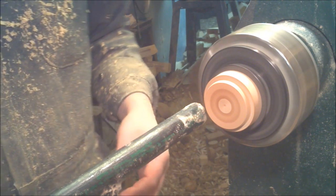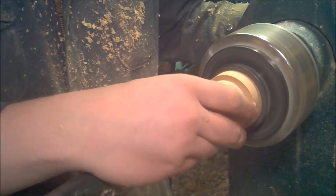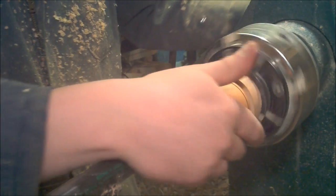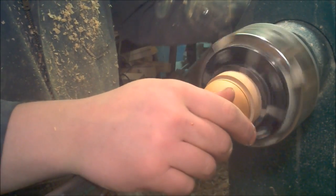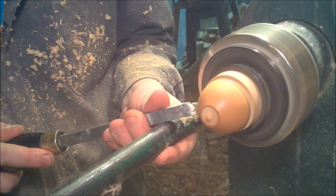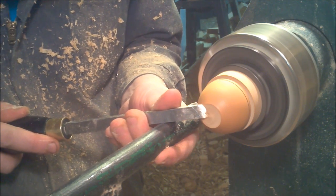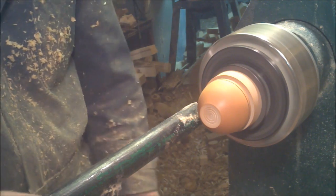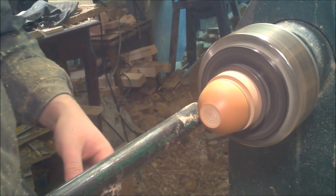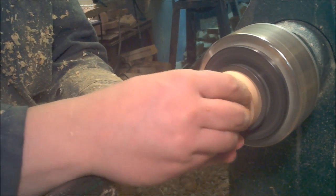Or if you hit too hard you might split the piece. In this case I just need a light shave at the now burnished place that I can see. You can get away with a mounting as sloppy as this — kind of like centering in pottery, or you might eye that ring to see where it's eccentric and adjust from there. The tip of the skew takes a nice little trimming cut, and a little addition to some detail. A little sanding, a little oil, and I believe we're done here.